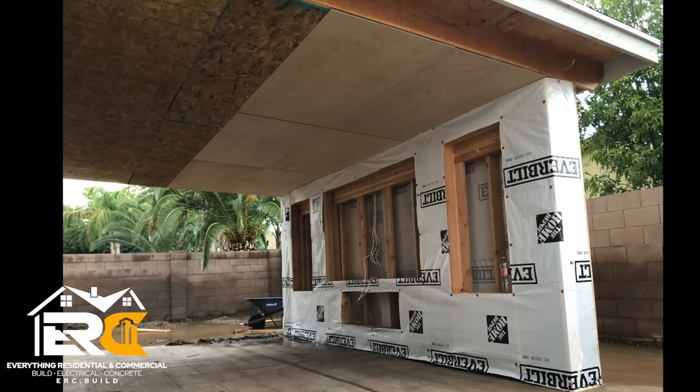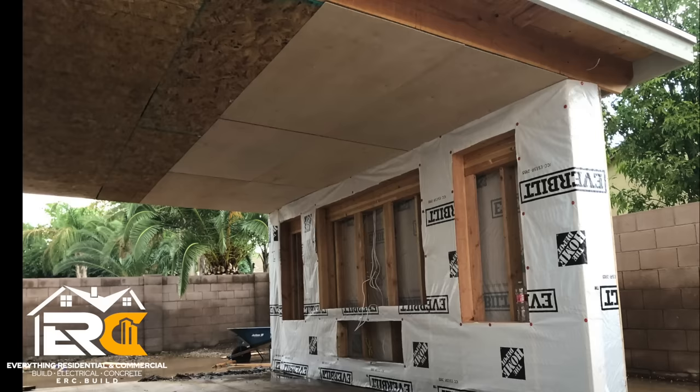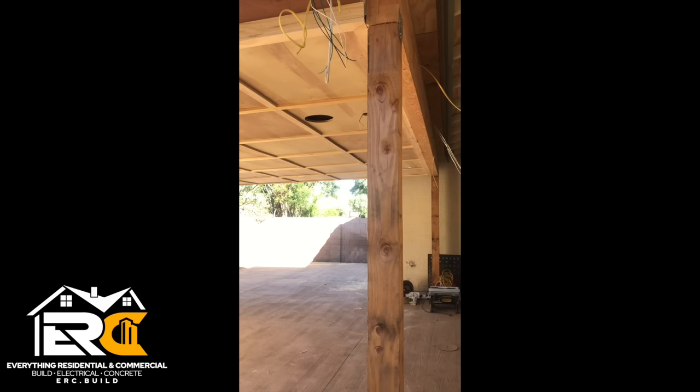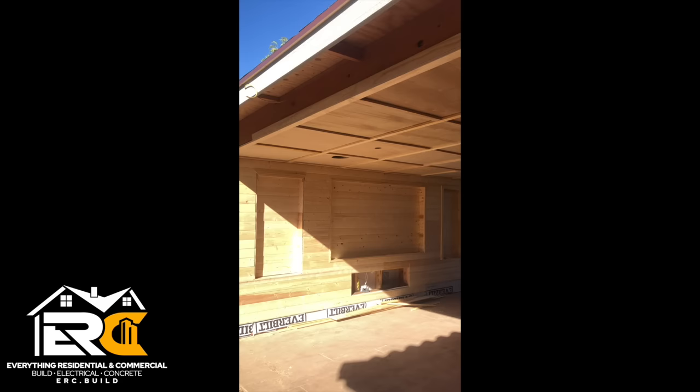This is super important: when you're going to attach your board and batten ceiling, you have to put your plywood up there. Since it's quarter-inch birch it could bow if it's on the rafter spacing. So if you put plywood on your ceiling, you can cut your birch to the exact measurements for a perfectly squared finish. The boards land on the plywood — not on a rafter — and you get this perfect finish. All the trim is 1-by-3 select pine, which comes very straight; it's the best kind of pine you can get, though it's a little more expensive.